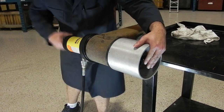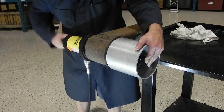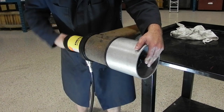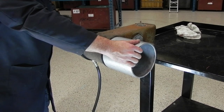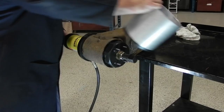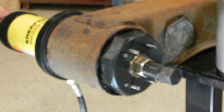We tighten that up one last time — you should have to tighten this up about three times total, because the cylinder pulls two inches each time. On occasion you may have to tighten it up a fourth time if you haven't tightened the bar all the way each pull. Then apply the hydraulic pressure again; on the last pull, grab a hold of the sleeve over here, because as the hydraulic pressure pulls the bushing in, the sleeve will release. Release it, and now our bushing is installed.